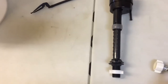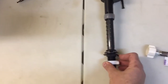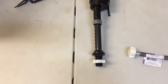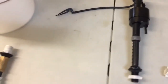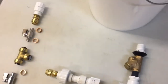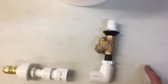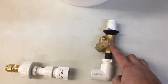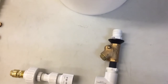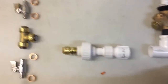This is actually a bulkhead fitting — I'll cut a hole in the bottom of this bucket, this fitting will go inside the bucket, this part goes on the outside, and the rubber gasket goes between them so no water drains out. On the boiler-fill side, coming out from the bottom, I've made a similar bulkhead gasket that goes into a check valve so water can only flow into the boilers — it can't come back up.